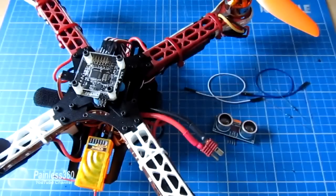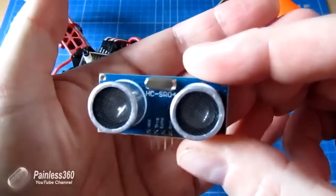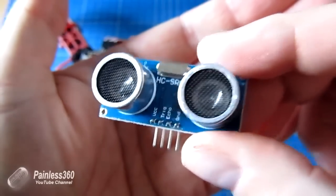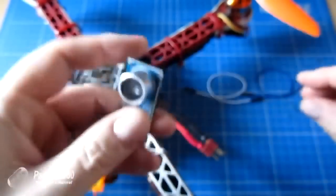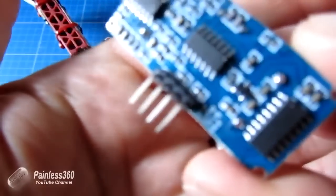This board is actually an HC-SR04. You can get them from loads of different places — eBay, Hobby King, all the usual suspects — and it's a relatively inexpensive piece of kit, only a handful of pounds or a couple of dollars. It's a relatively simple device with four pins on the back: plus five volts, ground, echo, and trigger.